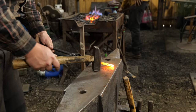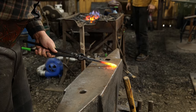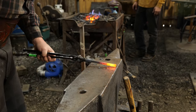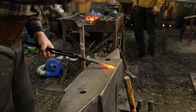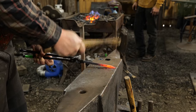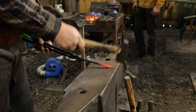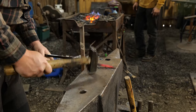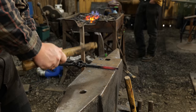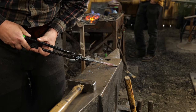Now to make our one-sided taper for our nail or chisel point. We're going to start by driving a good amount of material this way to create a nice little chisel — you can see it kind of flares a little bit, then we're going to turn that up. This side is where we actually establish our flat chisel point, square it up to the bar stock. We're looking for about a one inch taper. It doesn't really matter what the point looks like, just as long as it's roughly a one inch taper and it's true to the original bar stock in one direction — a nice little one inch taper, all on one side.